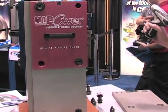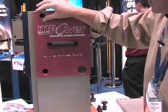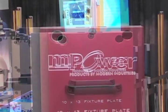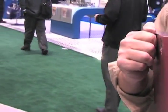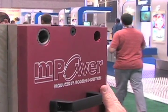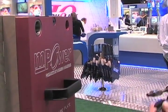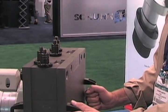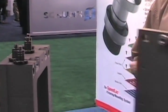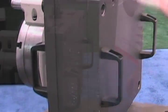It's also a stackable system. This is our retrofit system, similar to other systems on the market — it projects up a little bit higher above everything. And this is our compact locator system that's flush-mounted. To put these in, there's no dowel pins or anything — it's built with a docking station. I can put this down onto the fixture without having to swing it in and insert something while clamping at the same time. I merely just bring it in — it's 15 thousandths below center, and now it's within four-tenths repeatability. Many machinists who see this for the first time get very excited by what the docking station does.